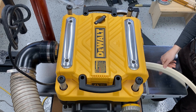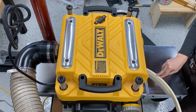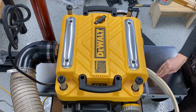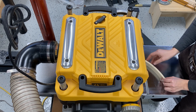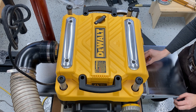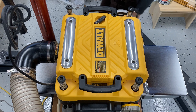I'm going to send this through into the planer like this. And then as the planer is cutting the piece, I'm going to grab this outer end and start twisting the curve through the planer so that it continues to cut with the grain of the wood, with minimal tear out. Then I'm going to let it go at this point and it's going to be fed all the way through.